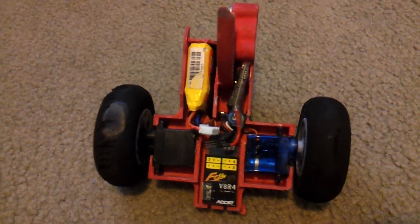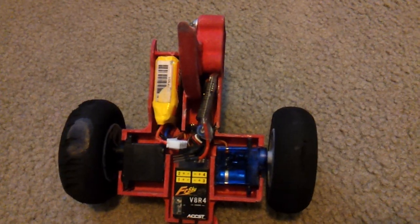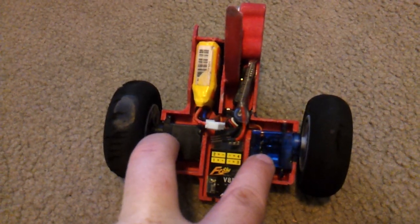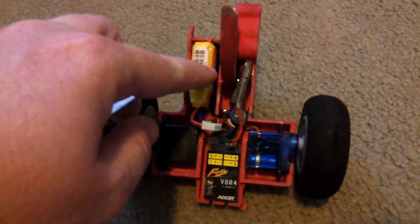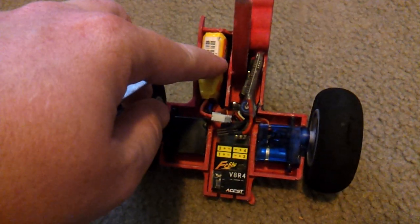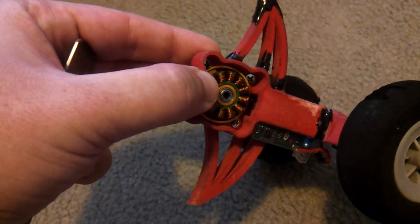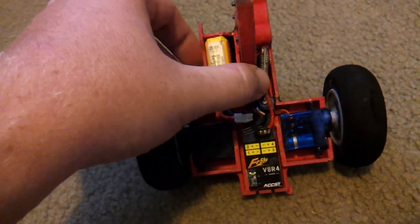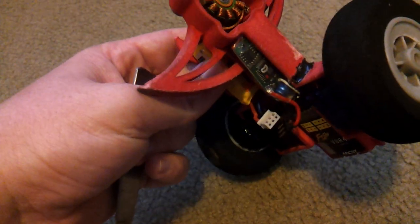So all up, the only parts you really need for a robot like this are a small 4-channel receiver, two 10g servos, one small 2-cell lithium ion battery, a small brushless motor — the 2204 is a really good motor — and a brushless controller rated for 10A.